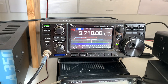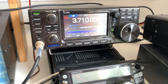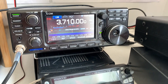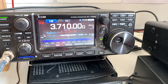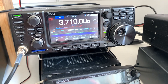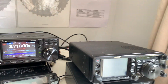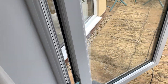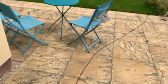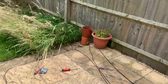Rather than do it on one of the HF nets — and although the antenna, the end-fed wire, is matching okay — even with only a few watts of power the SWR is moving around. When I wind the power up to sort of 90-plus watts I think I can see some arcing inside the ATU, so it was pretty obvious that all was not well.